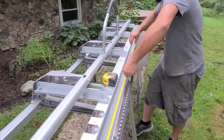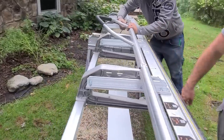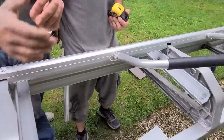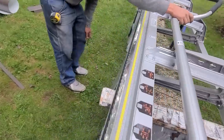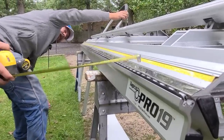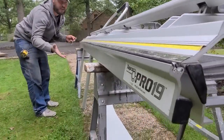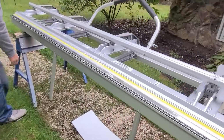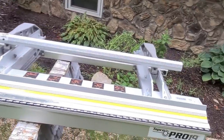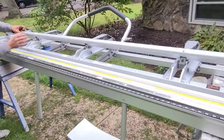This side pulled out — we need to tighten that side. Let's tighten it before we try to bend, or it'll pull right out. James is going to show you real quick how to tighten these. First key is to see how your brake is sitting. Pull this down to where your first point touches — we're touching already on the right and open in the center, then touching back here. That means our center ones need driving down or our edges need lifting up. It depends on how tight you want it to clamp.